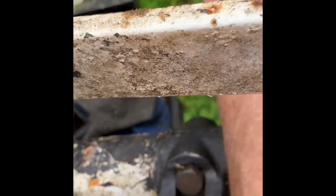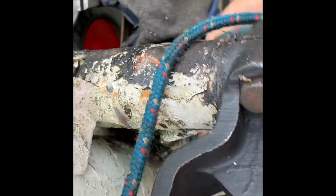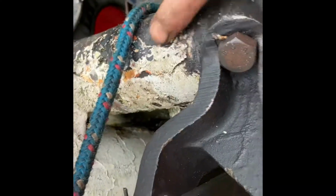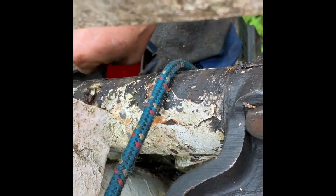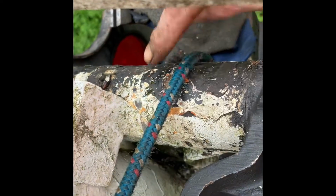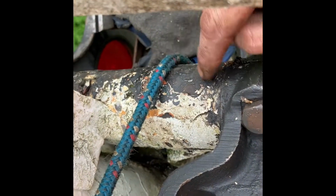Of course, now I've put this on, it's not as easy to show you. It wraps round the round part of the casting and you bring it back round over itself there, so it acts like a snatch point. And then you can lower it down quite happily using this basically as a winch, because it is round and the weight will carry it down.